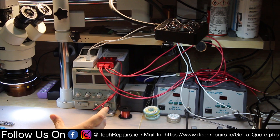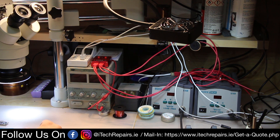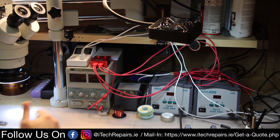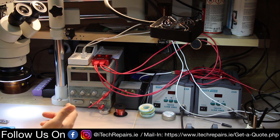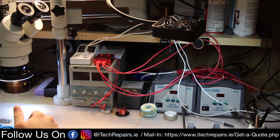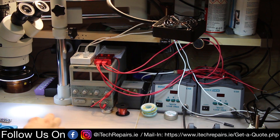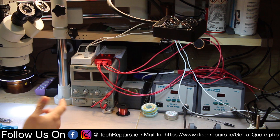The main feature I like about the USB charger is its diagnostic ability. For example, on an iPhone 6S it shows one amp or 2.4 amps. If the phone is okay it charges at 2.4 amps; if there's a problem with the battery, power IC, or charging IC, it stays at one amp. Also, if the battery is faulty, plugging in the phone will show the battery as full at any given percentage — so batteries that fail at 25, 35, or 40 percent will report as full, which helps diagnose a faulty battery.